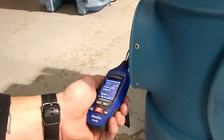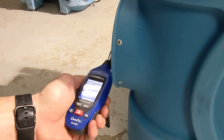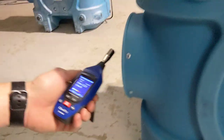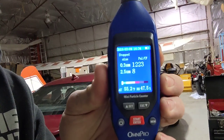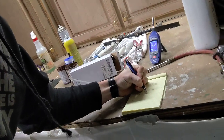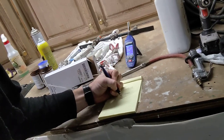All right, we're back. We have about 20 more seconds — I just wanted everybody to see what the numbers were without sitting here watching the screen forever. We have another 10 seconds left. It looks like we're at about 1,200 particles at 0.3 microns. Numbers done. Let's turn this air scrubber off. At 0.3 microns we're at 1,223. At 2.5 microns we were at eight. So let's write that down: 1,223 and eight.